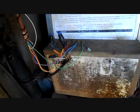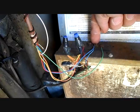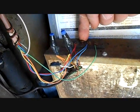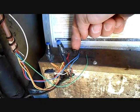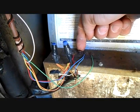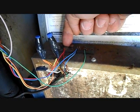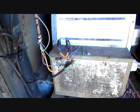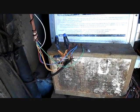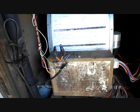Our wiring at the terminal block is finished. First we have our green wire — that's our fan wire from the thermostat. Second group, two blues is common. Third is W for the heat strips, which is sectioned off because the heat strips are damaged — taped off from both the thermostat and the condenser, because the condenser will initiate a call for heat strips during defrost. 24 volts hot going to both the condenser and the thermostat. The last one is a Y terminal that is unused because it doesn't go anywhere underneath the fuse block, and we can just send the signal straight out to the condenser.